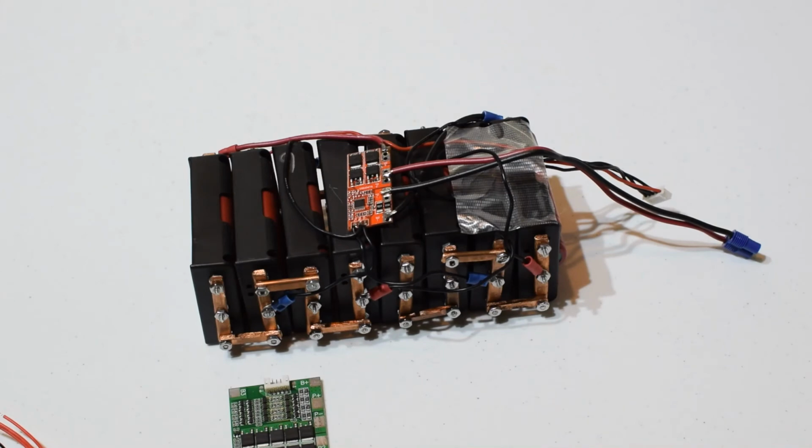All right, so looking forward to the new and improved version. We're going to get a better backpack. I'm going to use more flexible wire, and then we're going to capacity match the cells. I'm going to use a little bit newer cells. I want to shoot for the 2170 cells, the Panasonics from the Model 3 Tesla. So a little bigger capacity, and I haven't played with them yet, so that'll be fun. Hopefully they'll be new-ish or newer and better matched cells. These ones were harvested from laptop batteries, and this is before I capacity matched cells. So that was a little detrimental to the performance of the pack. Still useful, but not as good as it could be.